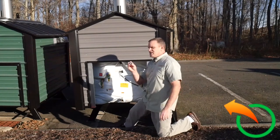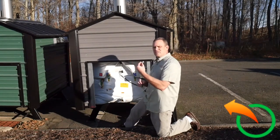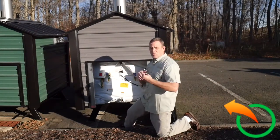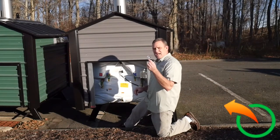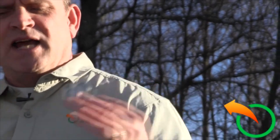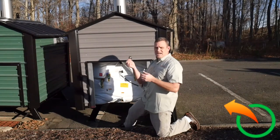The purpose of it is that when it monitors the temperature of the water and it exceeds 190 degrees, it turns off the electricity to the fans to prevent it from overheating and boiling over. It's a safety system. They're a very simple, mechanical, spring-activated system. What also happens is that you want your unit to turn on and it won't turn on the fans because it overheated, or simply maybe the snap disc went bad.